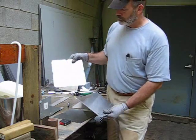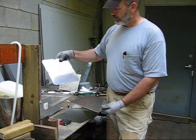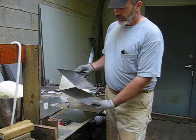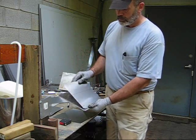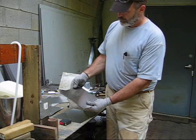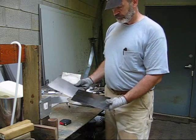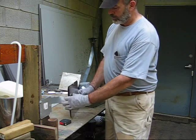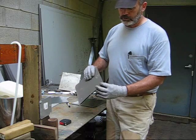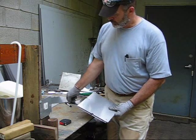This plate I had all notched out for positive and negative — I thought that was a lot of extra work, turns out it's not necessary. All you have to do is do the neutral plate that's next to the negative, and the neutral plate that's going to be next to the positive. Make sure you get that lined up right. These corners don't need to be cut off where there's no terminal to get in the way, but right here in the middle those have to be cut out to allow clearance for your terminals.